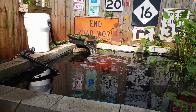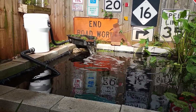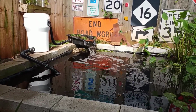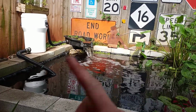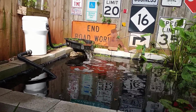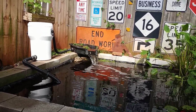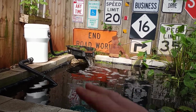So if you got a pump and you constantly got leaves and trash and just all kinds of stuff getting sucked into it, I'd recommend taking a 5-gallon bucket and drilling some holes all the way around, about 1/8 inch big. There's no right or wrong way to do it as long as it can get water flow. And then pour some gravel a couple inches from the bottom, put your pump in there, and then bury it. That way the pump's not at the bottom.